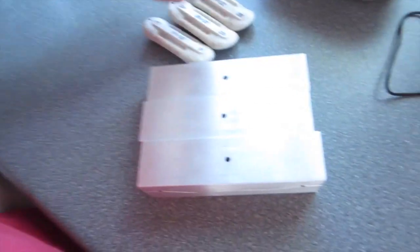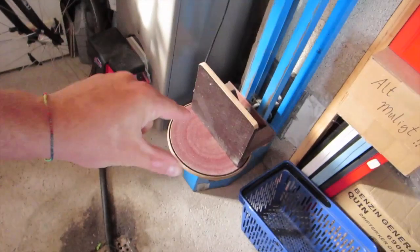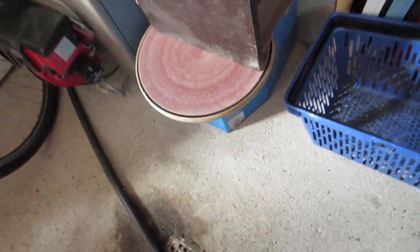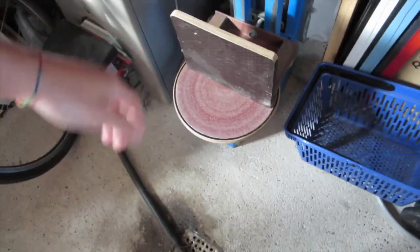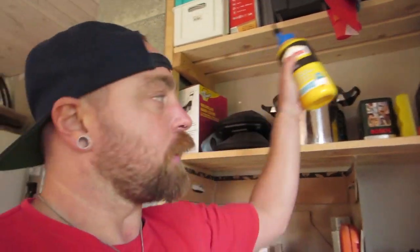You're not only just going to need the molds — they actually come with 10 plates, which is cool. You're also going to need some sort of sanding device unless you're going to do it by hand, which takes forever. But this is my sanding device — an old lathe that one of my mates has set up so I can use it. You're also going to need a drill press to make sure your hole is going to be even and your countersink. You're going to need glue, and you're going to need veneer, which can be very hard to find.